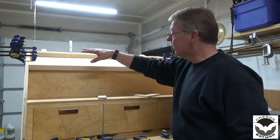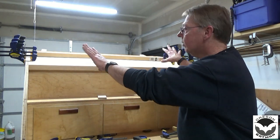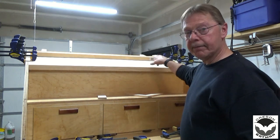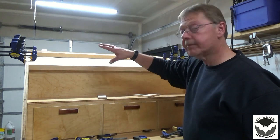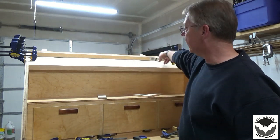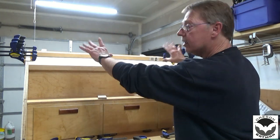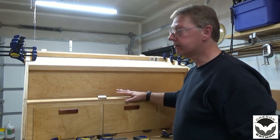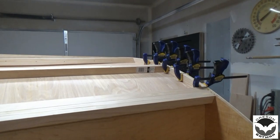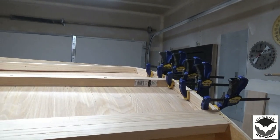Now while the first set of spacers are set in place, clamped and glued, we're going to let those set up for a little while. And in the meantime, we're going to go ahead and prep our second set of spar, and we'll get that in position. And I think we can actually glue fasten that one down. Then we'll just continue moving forward. Yep. All right, so the old adage is true. 2 steps forward, 1 step back.